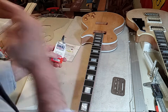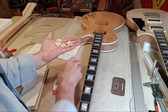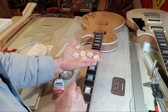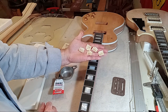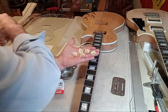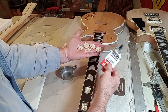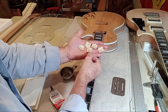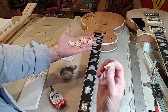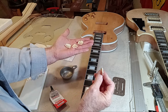This is pretty critical. And for you guys that are out there building a guitar, I might cover this in a little while, but basically, I did some really detailed research about how binding reacts if you glue two pieces of binding together using SIG cement. Doesn't work, not if you're doing white to white, but if you're doing white to black, it's fine. But if you're using Stuart McDonald glue, it's pretty darn good. Or just straight acetone versus jet glue. In other words, I came in and did some real detailed analysis. Jet glue did not work. It left a pinstripe. Okay, jet glue meaning CA glue. Acetone, straight acetone, pretty darn good.